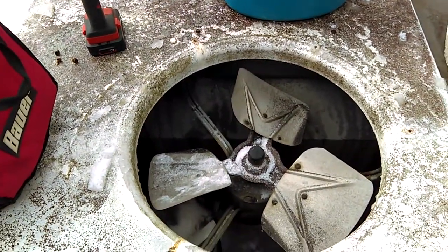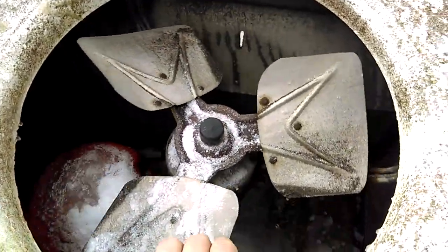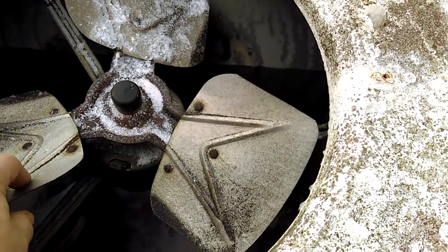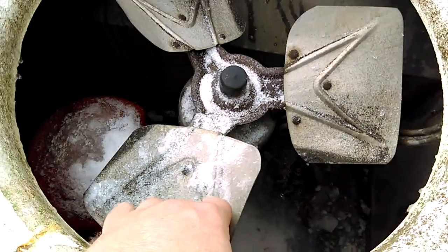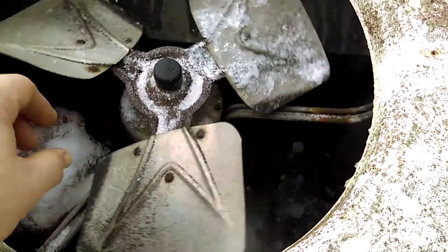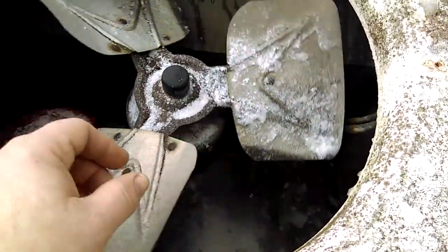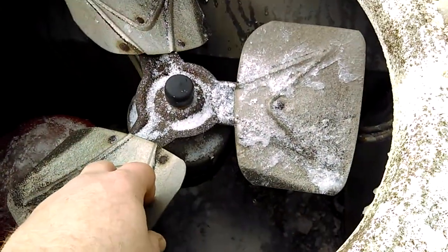But there's a problem with having it off: you will get ice buildup on your fan blades. In my case, it's uneven ice buildup. I've got three fan blades here and only one of them has significant ice buildup. I went ahead and turned it on a few minutes ago and it sounded horrible, because the fan blade spins — in most people's cases — over a thousand revolutions per minute, and it's out of balance and wobbles a lot.